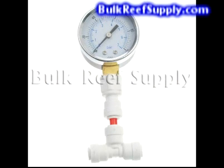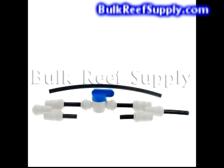The system also comes with a pressure gauge which does two things. First, the pressure will drop when the filters get clogged, so it will help you know when to change your filters. It will also help you troubleshoot your system since most problems are related to water pressure. The plus unit also comes with a flush kit to bypass the flow restrictor on your membrane, allowing you to flush deposits off the membrane surface and prolong its life. We recommend opening the valve for a minute or two before and after using the unit — in normal operation it should be closed.